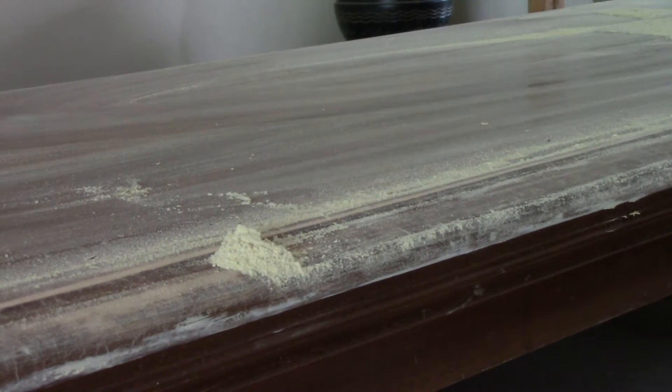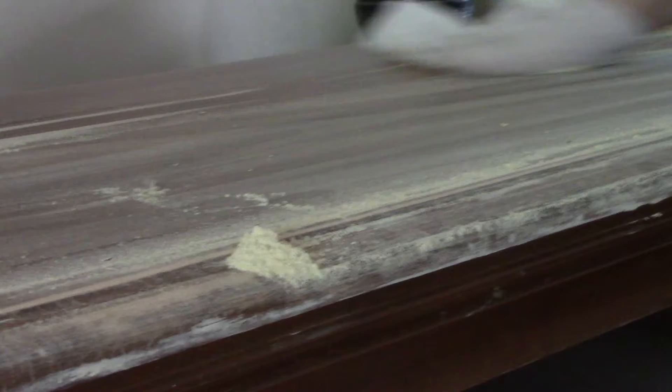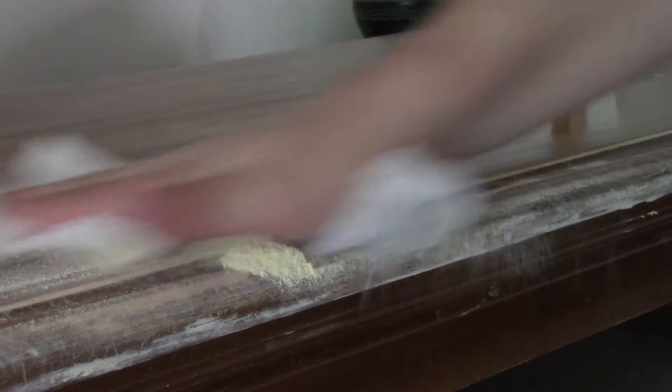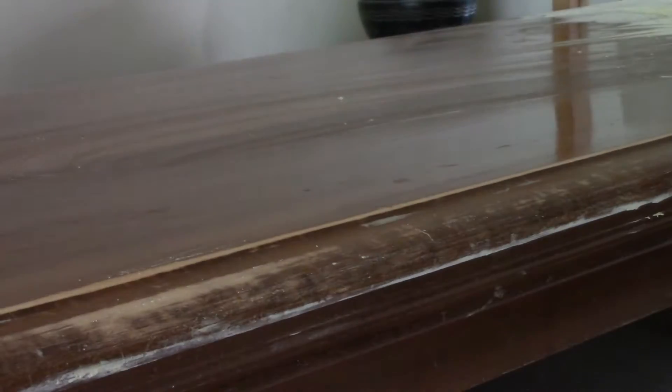Because I used too much wood filler, I had a lot of sanding dust to remove. I just took a nice wet paper towel and cleaned that off. You can also use TSP — trisodium phosphate — which is specifically meant for cleaning off surfaces and preparing them for paint. You'd especially want to use that if the surface is particularly dirty, like if it's been in a garage or there's grease on it. Just make sure you use gloves and eye protection because you don't want to get it on your skin or in your eyes. Once everything dried, I went over everything with a tack cloth as well.